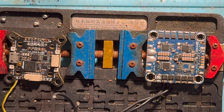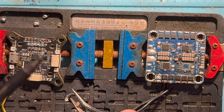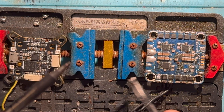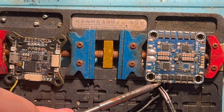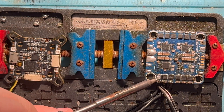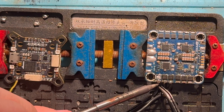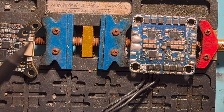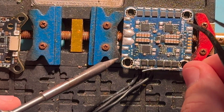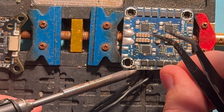Not a big deal at all and like I said these boards are toast anyway. But if you're working anywhere in the vicinity of the board and doing any kind of soldering you really need to be aware that these little pieces of solder can just pop off at any point in time, and it's not a good thing. Also I'm really not happy with this joint — let's see if I can do it better. You want that round ball look.